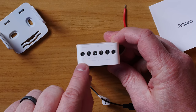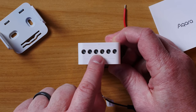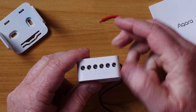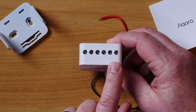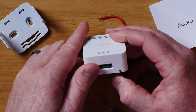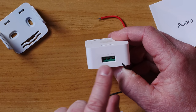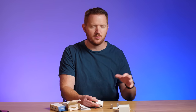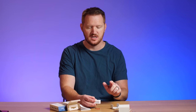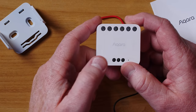On the device at the top you have L1 and L2 — those are your loads for load one and load two. Then you have L out and L in, used for dry contact mode, which you short out in wet contact mode. L is for line — the power coming in — and N is for neutral, so you will need a neutral line. On the bottom you have S1 for switch one, S2 for switch two, and COM communicating to the switch. You tie COM to the bottom of the switch and S1/S2 to the tops, so the original switch works without replacing it. There's also a button to reset the device or manually toggle the switch.